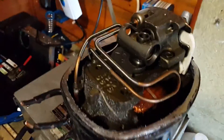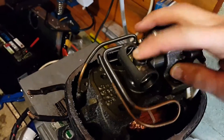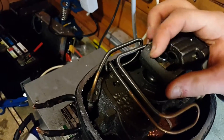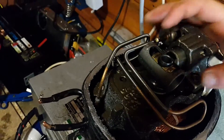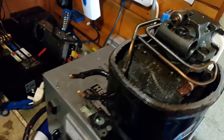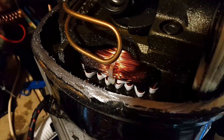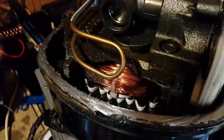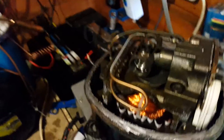What an unusual little compressor this is inside. It has got a funny connecting rod arrangement — quite a strange configuration. I have seen it in other videos. But looking at the motor, it may be possible to rewind it. I don't know, because as you can see some of the slots are bigger than others, because it is a single phase motor. Though I still might be able to do something with it.